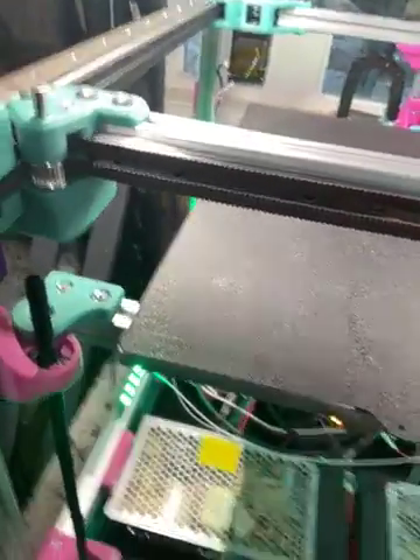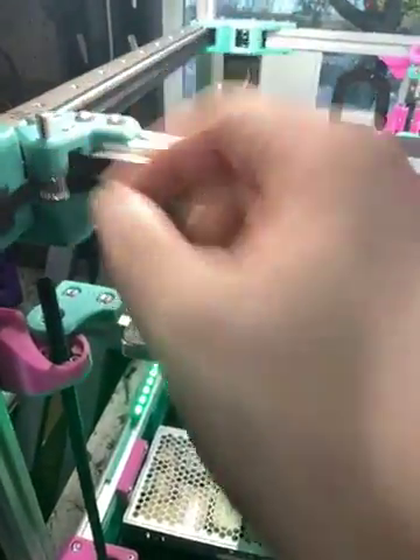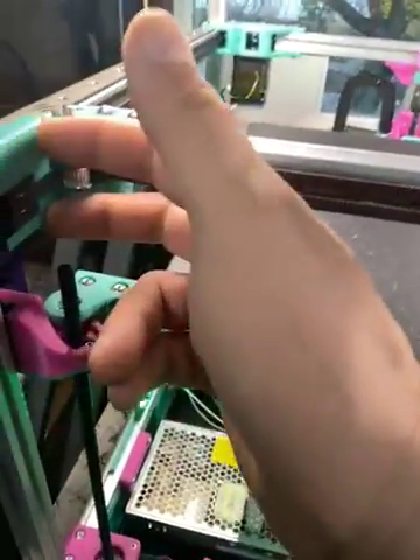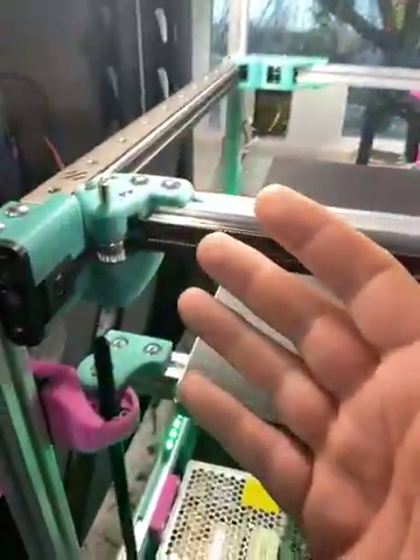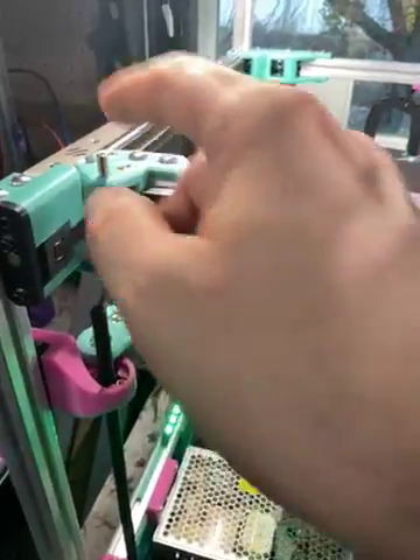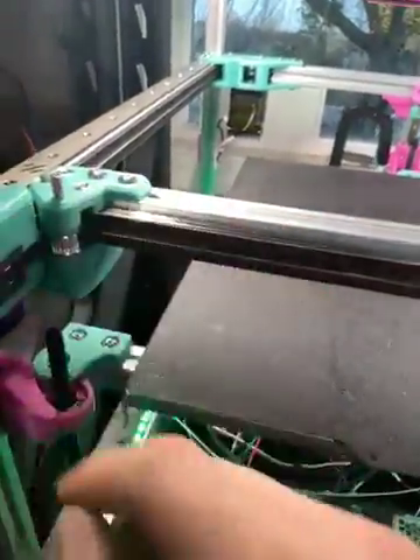And that's kind of what you do. If you have a 1.5 millimeter Allen wrench and your gap is 1.5 mm or less, you can kind of get the belts to fix it — because you're just going to tighten one belt, though tension will be off a little bit. Not ideal, but you can do that if you're just getting too frustrated and want to move on to the next step, because you can always come back to redoing this. This is not set in stone — you'll constantly be able to adjust it.